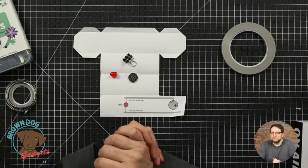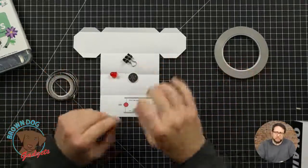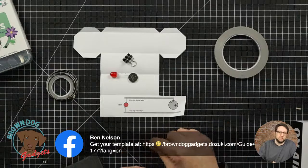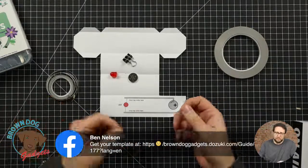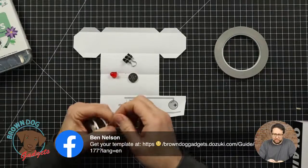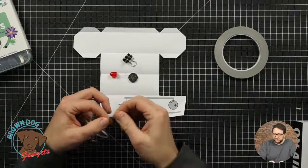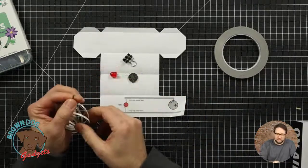Now, Pete, before we use the maker tape, could you tell us what makes maker tape so darned awesome? Maker tape is pretty amazing. If you've ever built a paper circuit or a circuit using conductive tape, it's probably been the copper tape. Very popular for that. But the issue is it's really only conductive along the top side of it. So, connecting things together can be a little difficult. You have to fold tape over, stuff like that. The maker tape is very nice because it conducts all the way through, top and bottom, and through the whole thing. So, you can loop things around, you can tape things on top of each other. It's also a really durable tape. If you stick it down to something that isn't paper, you can often peel it up and reuse it.